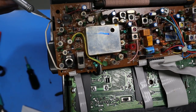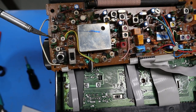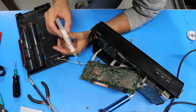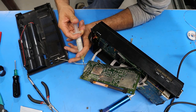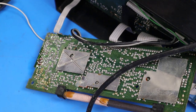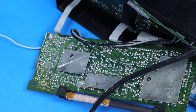Here's where the transistor was — you can see the Q115 reference designator was under the part body, and you can also see the outline of the part so I know which way to put it back in. I did clean up the solder pads with the solder wick, but I'm going to put a little flux on here anyway just to help everything flow well. Now I'll trim the leads, then clean this up with a little isopropyl. Just to make sure there are no shorts I'm going to get in here and inspect it with my magnifier. I think we're good to go — I'm going to put the radio back together and we'll try it out.